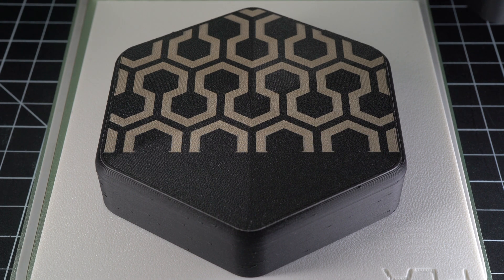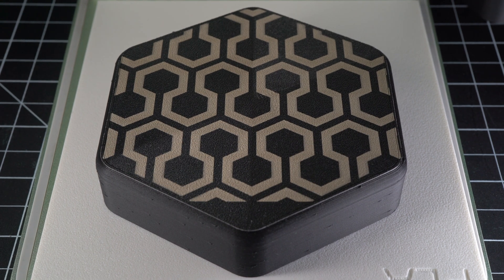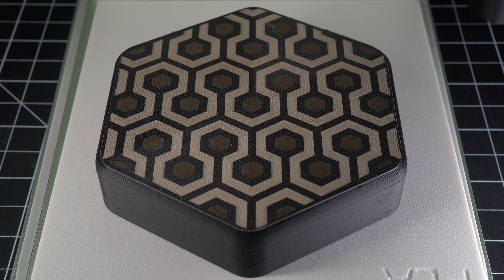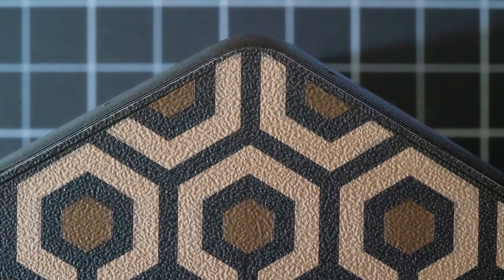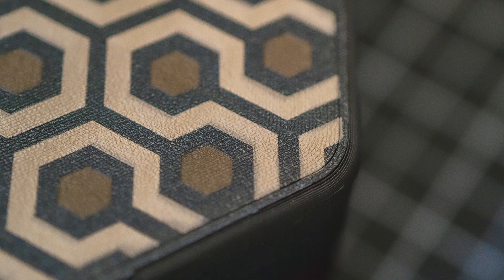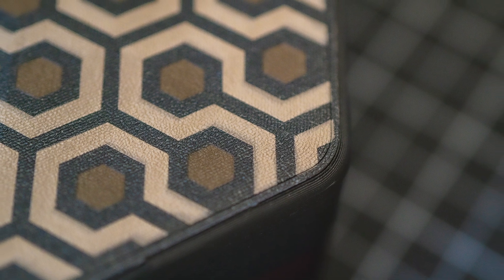But you'll have to remember to place those lines far enough from your design so that they fall onto the bed and are not etched into your piece as well. If it is viable for your project, this technique should hopefully address any remaining issues you have with any specific sections being excessively heated by laser contact when using the engraving mode.